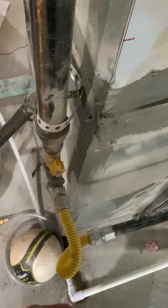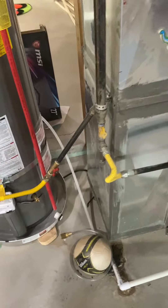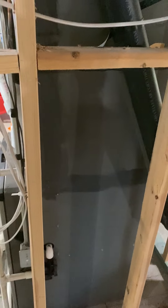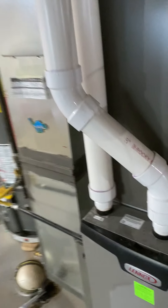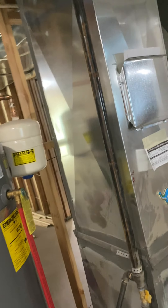For the drain, just put in a P-trap and drain to the floor. On the gas, we're just going to extend this out and then re-hook up this flex. The thermostat — he just wants it on this wall, right on the right of the furnace, in this area somewhere. Just a basic Honeywell thermostat is fine. Jamie has that and the zone panel in his office, so make sure they did get pulled — if not, he does have them.